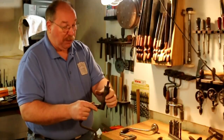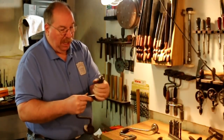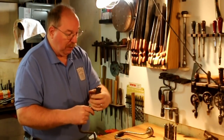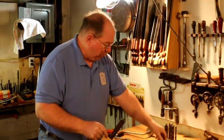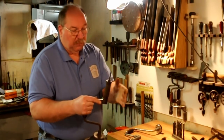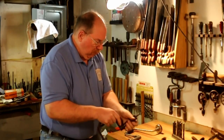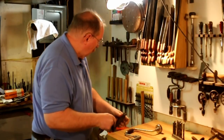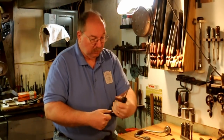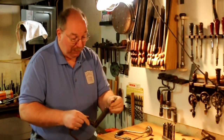Now this is similar to that one, but instead of having the outer collar come off, the inner jaws slide back and forth. And it will grip all the various types — the old set screw type and the more modern type. It will even grip the standard straight shank ones, as long as it's above three-sixteenths of an inch.